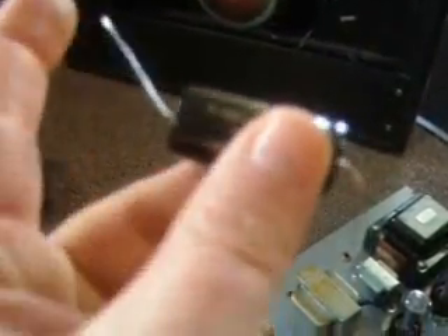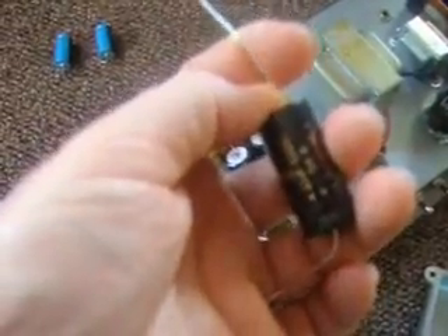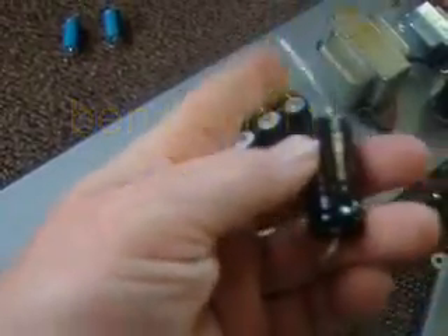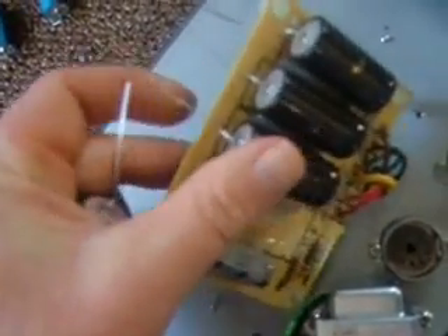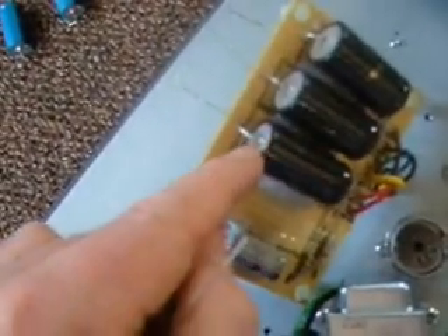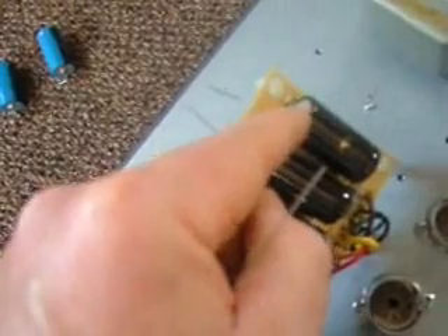In this case, I've got one that's bent just about how I need it, and this one bends in a completely different direction — the last thing I want to do is roll it around and twist it. This is my positive and this one is good as it is — nice arc on it. Make a little knuckle there, a little support, and bend it. I'm putting them through and pressing them down tight into the silicone that was there, and I'll add a couple drops in between them afterwards. With my pliers I grab gently on the other end and give it a little tug to make sure it's down tight, trying not to create a hard bend where it comes out of the capacitor.